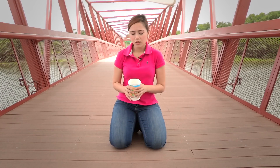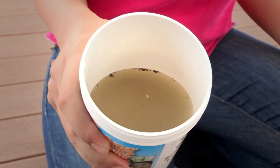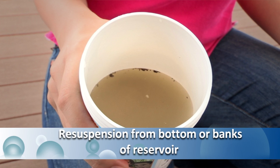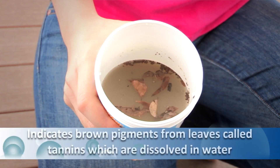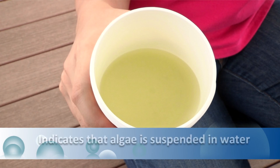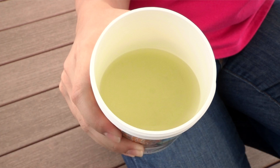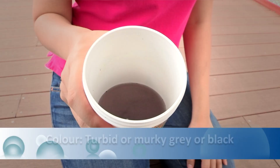Colour can give some indication about what may be present in the water — there could be dissolved pollutants or even bacteria. However, coloured water does not always mean that there's pollution. The colour of water from our reservoirs or waterways should be colourless or slightly green due to algae, which is normal. To test for colour, hold it up in a well-lit area and check. Turbid or murky brown indicates soil particles; brown or dark brown indicates tannins from leaves dissolved in the water; green or yellow indicates algae suspended in the water, possibly an algae bloom caused by high nutrients, fertilizers, or organic matter. Turbid or murky grey or black indicates the water is polluted.